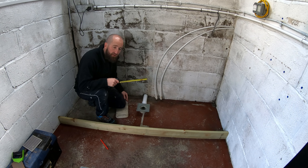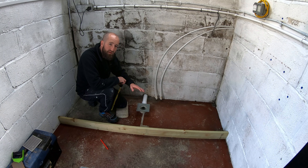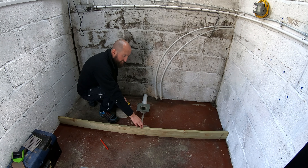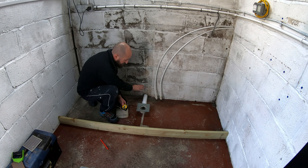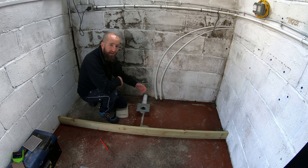I've had a bit of a recalc and readjustment of this drain — now it's about a 20mm drop from the intended surface of the concrete to the drain, so a nice slope from either side and from the back here as well. We also have quite a nice fall from here through the wood store on this side. It should drain absolutely perfectly. The last thing I wanted was to install this and then have a massive puddle where the water doesn't drain out. That would be hell.